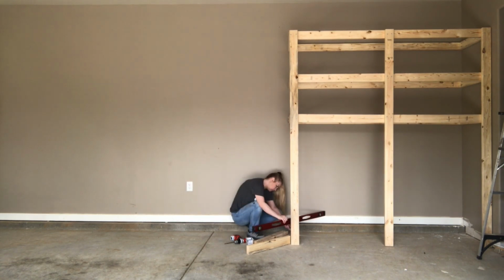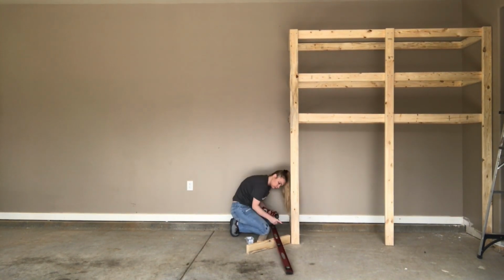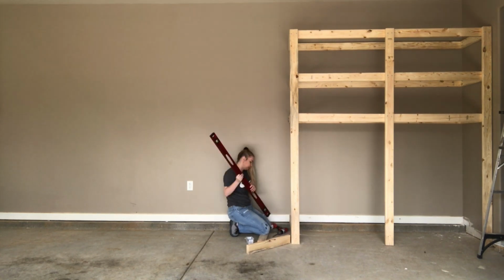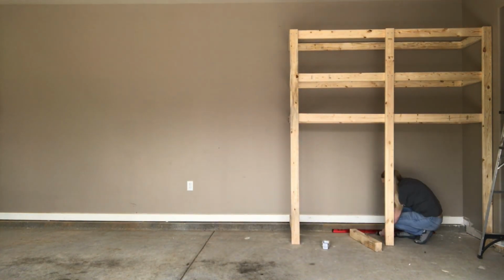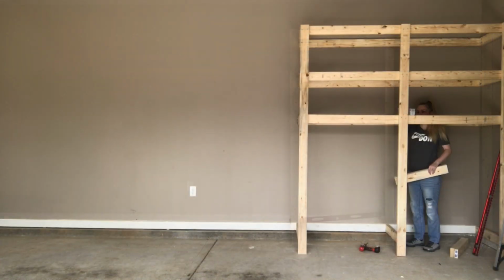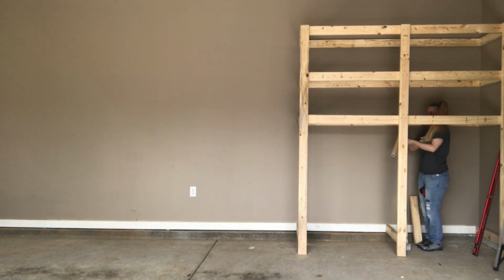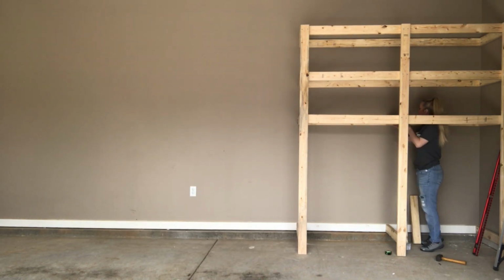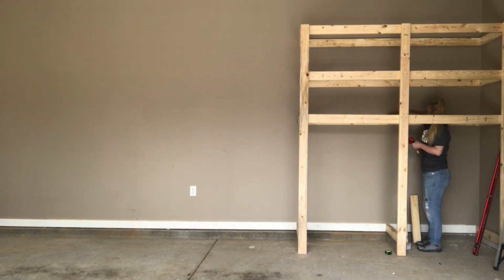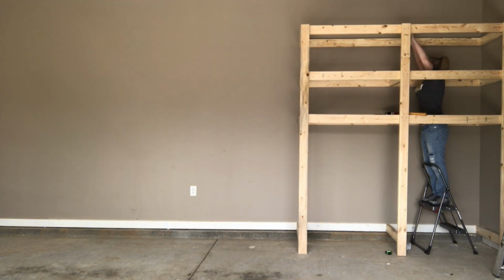Now you've probably noticed that I have open bays down at the bottom. This is so that I can roll things into these bottom areas. However, I am adding supports at the bottom of the legs to make everything sturdy. I'm also adding cross supports centered at the location where my plywood seams will meet. I recommend that you have supports at least every 48 inches, and you should space them closer together if you plan to have a lot of heavyweight items on your shelves.